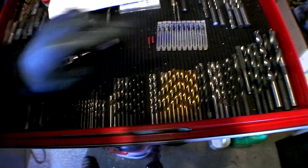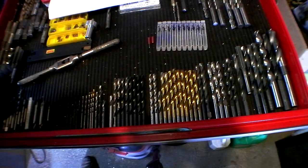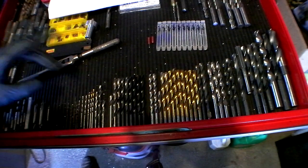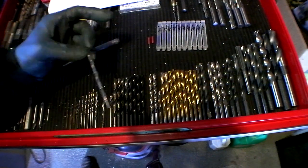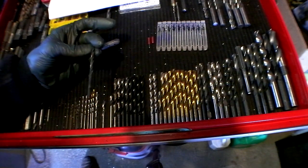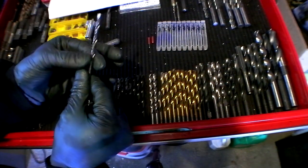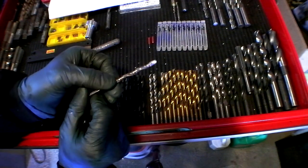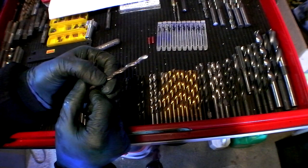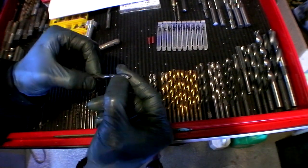I just wanted to have a quick little chat about drill bits. In my last video, making the 1.9 inch long motor standoffs, I had to use this drill bit — it's a 13/64, which is about just under 0.2 inches — and I had to drill 1.9 inches deep on the lathe, which is nearly the entire flute length of this drill. And it was stalling up a lot, even with flood coolant. Chips were welding to the tip; it was just getting hot.